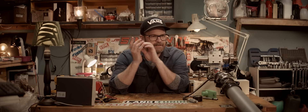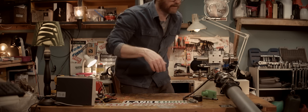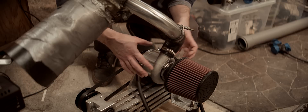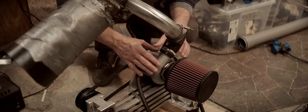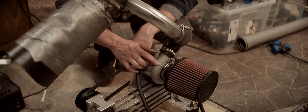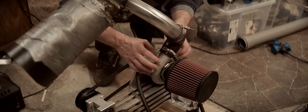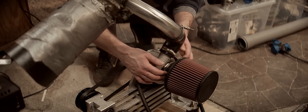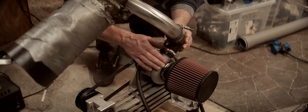A little bit of context: let me show you the blower while talking. This is my Rotrex centrifugal supercharger — pretty much the smallest one you can get. They used to make an even smaller one but it's out of production. A huge thanks to Rotrex. A couple of years ago I got this and started experimenting with it. All of that experimentation was with the blower on the wrong side of the surge line, and that's the problem. This can produce close to two bars of overpressure — a pressure differential of almost 1.8 from inlet to outlet — but it can't do that without pushing far too much air for my engine to ingest.